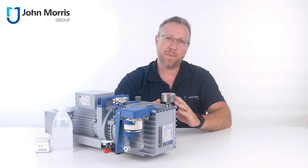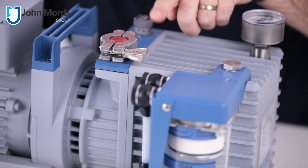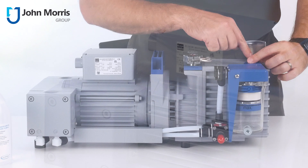And that's where the RC6 is unique. You have one motor here in the middle which drives two pumps. On this side you have a standard RVP achieving 2×10⁻³ millibar with just under six meters cubed per hour of pumping speed. And on this side you have a chemically inert diaphragm pump that applies a constant vacuum to the exhaust of the chamber, meaning that solvents do not condense and are instead scrubbed from the oil and passed into the exhaust.